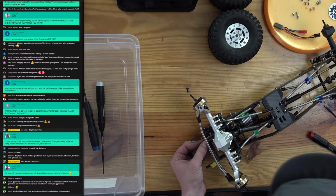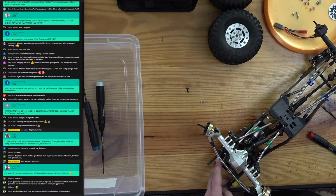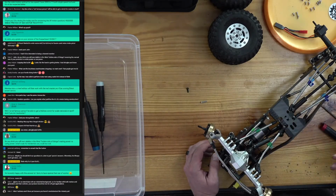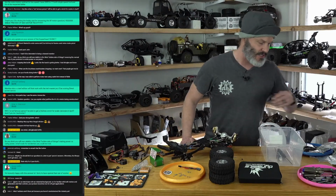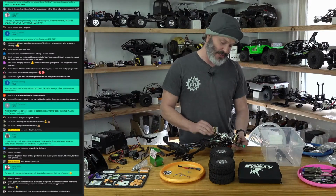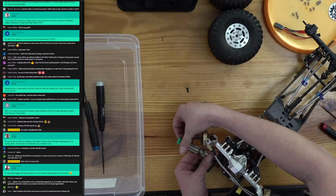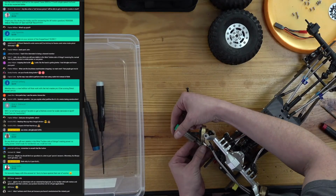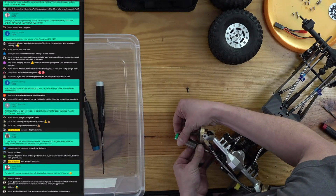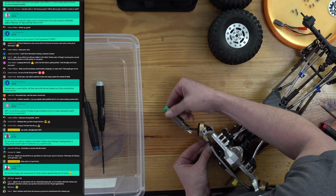But then, if you've got to run a motor on 500 volts and it's only designed for 12, I can nearly guarantee you that the insulation on the windings isn't going to hold up anymore, and it's going to become closer to a Tesla coil than anything else. Not quite. There's nowhere near enough voltage to do that, but the electricity will jump over from winding to winding, and it won't be a motor. And if you go too low on the turn count, it might not be a motor either, because it can't produce enough back EMF to really even turn.